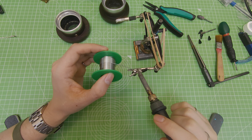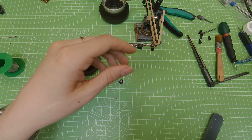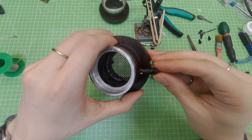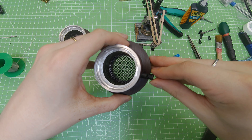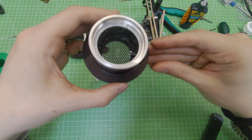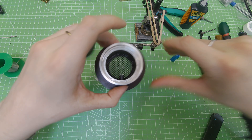These are 3-pole sockets, so what I'm doing is just connecting the ring and the sleeve together, and then leaving the tip and those other two as a single pair of contacts. That just simplifies things a bit and makes them compatible with even more cables. I just put a tiny little dab of superglue on there, just a little bit before I pop them in, and then that'll make them a little bit more secure, and we'll put some more hot glue on the inside just to really make sure that those things never come out.